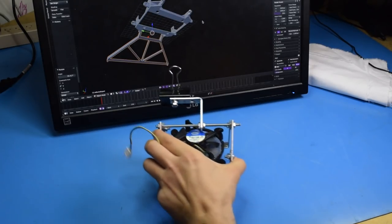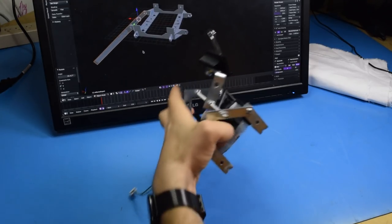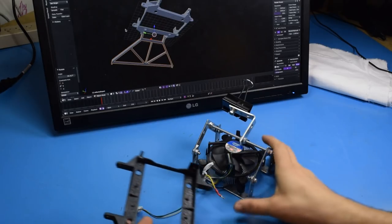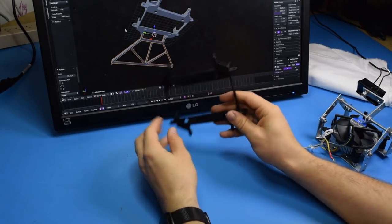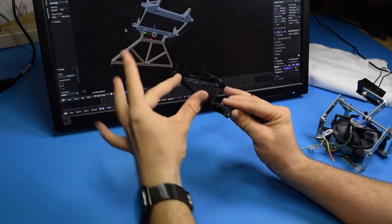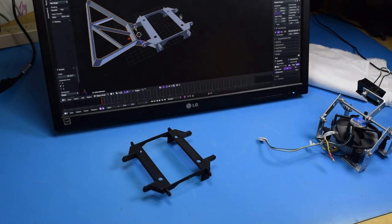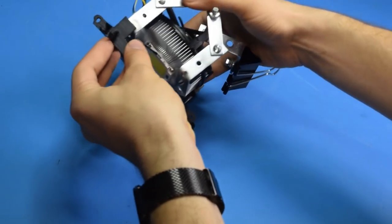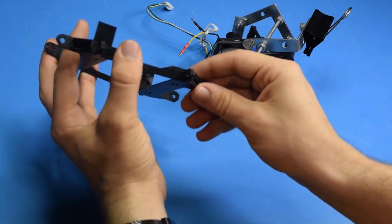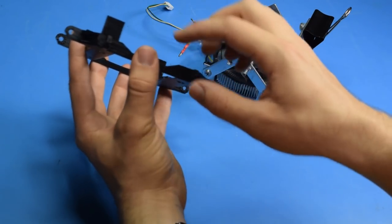I've been working on another phase of the design that has a 3D printed part that snaps onto the bottom of this and holds deflectors on all four sides. I have this initial bottom piece printed out already. The way it works is I have hinge gears around all four corners, and the deflector will go in here and allow it to be pivoted. On all four sides of the deflectors, I will have cutouts that hold in place a sheet of fabric to act as a diffuser. This piece just clamps onto the bottom of my existing design. I had to take it off for this video and broke it a little bit, but that's just part of the iterative design process with 3D printing — so I know I need this to continue up further to add support to the back.